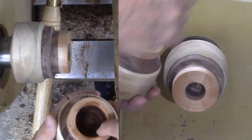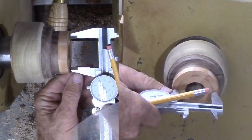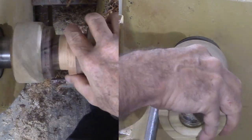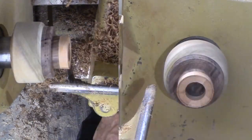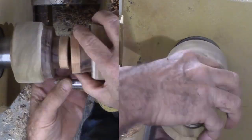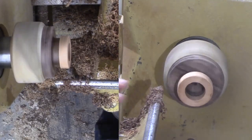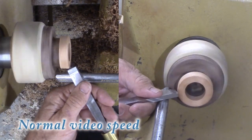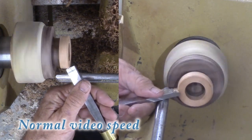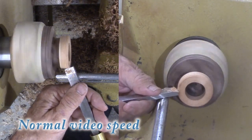For the male threads, I measure the inside of the female threads and add some. I'd rather be too big to start than too small. Then cut the ring down to that size and continue the standard fitting process to get close to the size. I'm leaving it big — that provides both insurance against cutting too small and a practice opportunity. Then cut a chamfer on the edge. Then start cutting the male threads across the chamfer. As the thread develops, deepen the thread and gradually move to a 90 degree angle to the wood. I am getting a lot of practice on the male threads since I left a lot of excess wood diameter.